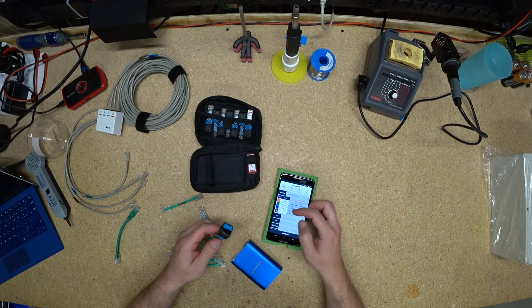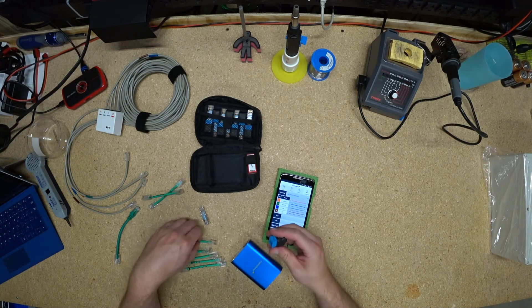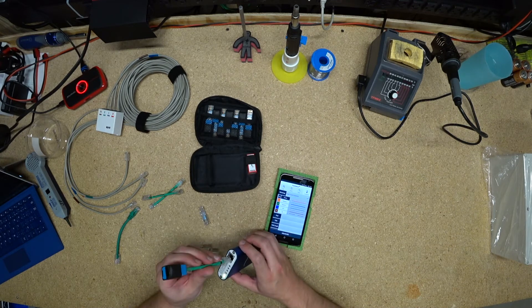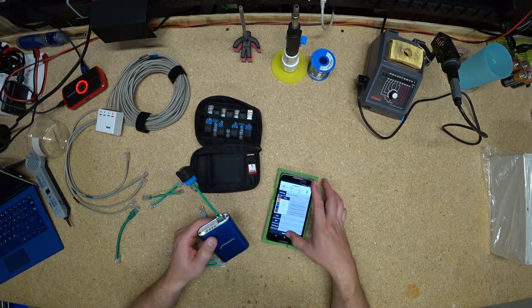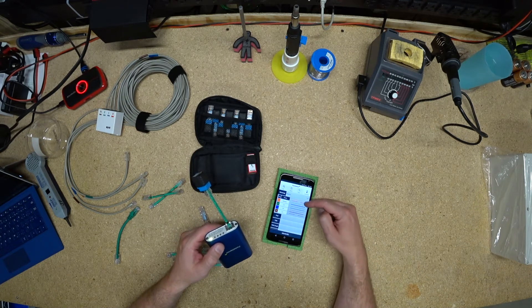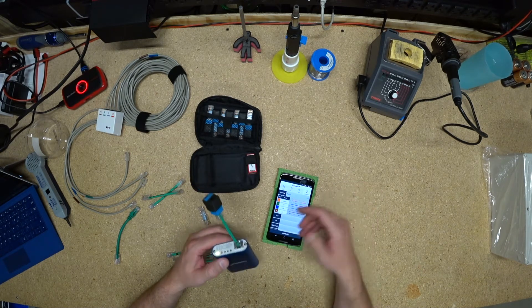Here's one that says open — pair two orange is open. So let's see what that looks like. Sure enough, pair two orange miswire. And you can see that break there, and all the rest of them are fine.